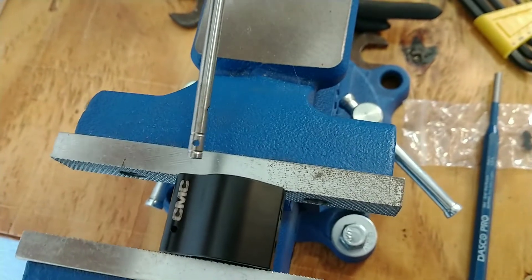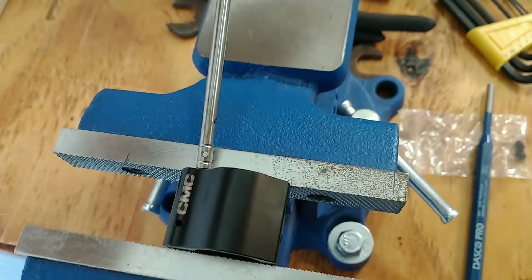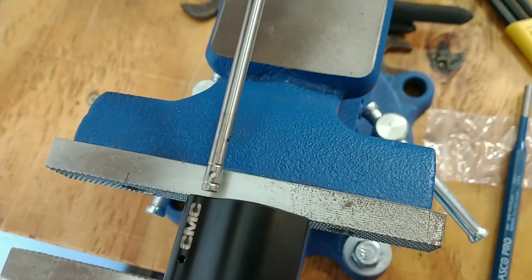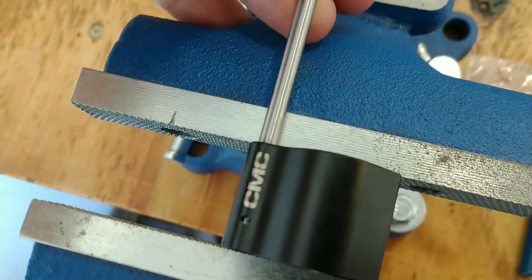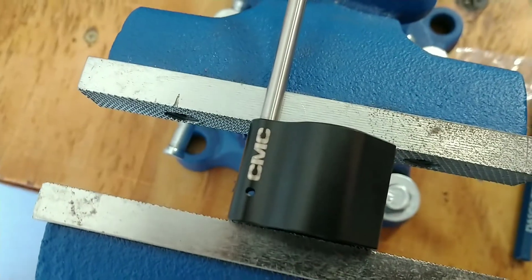You're going to have this hole lined up with the hole down here at the bottom so that gas can go through there, and you want to line up this hole — sorry, I'm doing this with three hands — in this hole. See that hole? Those holes lined up? And then the tricky part is getting that roll pin.